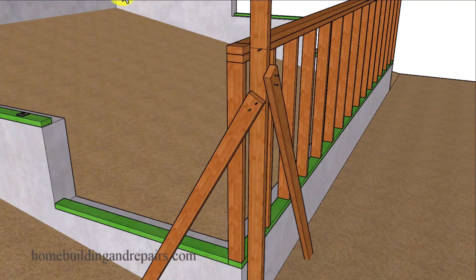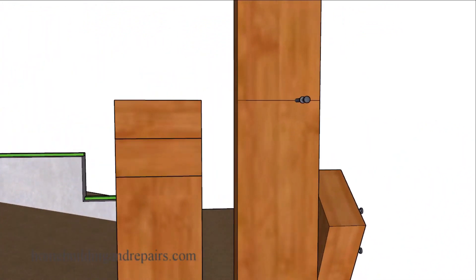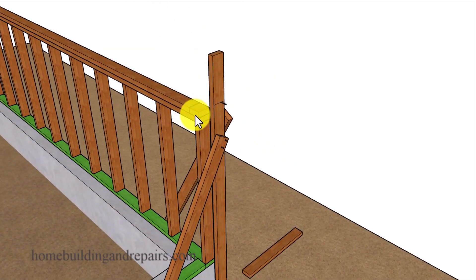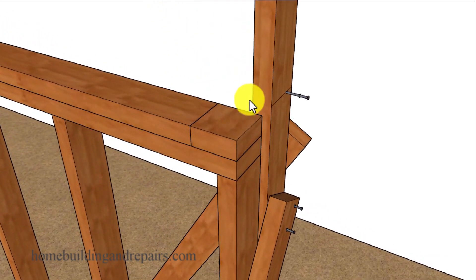You can always install a block here if you need it. Remember, this is a cutout for the other wall's top framing plate that's going to lap over this wall. You'll see the top framing plate on this wall extending past a little bit to connect to this wall. You can always extend this framing plate a little further if it's going to work better for your string line, and then cut it off later. Here are examples of the different nails you could put in the framing plate to attach your string, if you aren't going to use batter boards.